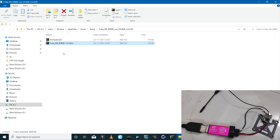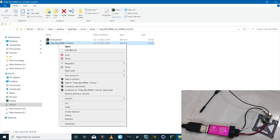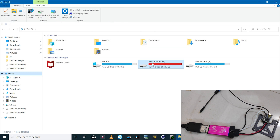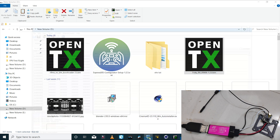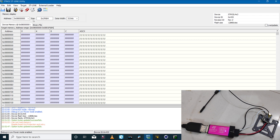Once done with the settings, I'll click 'Build' instead of 'Build and Flash,' because we will flash the firmware using the STLink utility software. Once the firmware file is generated, make sure to copy it somewhere accessible. The two generated files are the same content — just with different names. The trickiest part is the address field, and I contacted Mariano who helped me figure this out — a huge thanks to him.